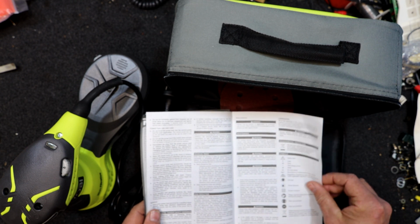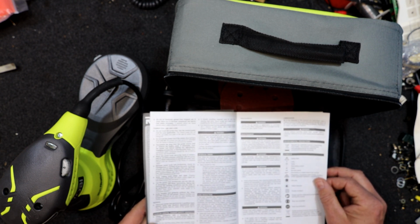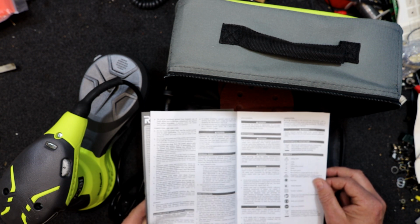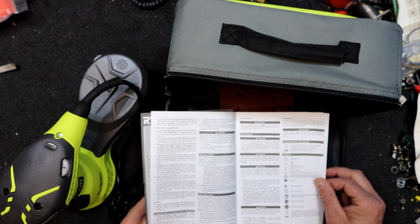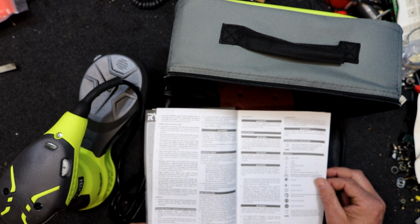General safety warnings, use and care. Clamp workpiece with a clamping device. I guess in other words, if you're sanding something smaller or loose with this thing, it can transfer its motion to the whatever you're sanding and move it. Don't use sanding paper larger than needed. Extra paper extending beyond the pad can also cause serious lacerations. Yeah, obviously you don't want it working near your skin anywhere.